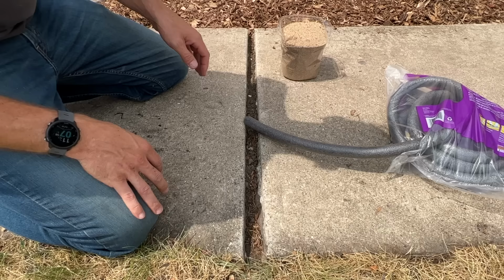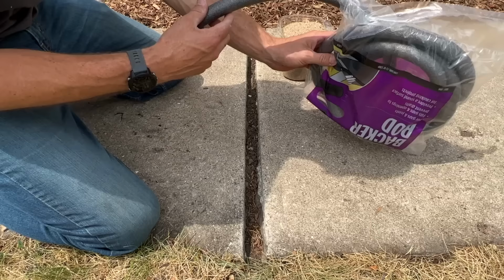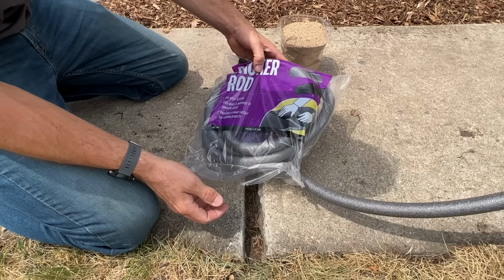If you had a consistent gap, 1/2 inch, 5/8 of an inch, 3/4 of an inch, all those can be filled with the standard backer rod. So just some backer rod that you'll find at your home improvement stores. 1 inch, I don't find readily available in my area, so I need to get it off of Amazon, and you'll see that link in the description.